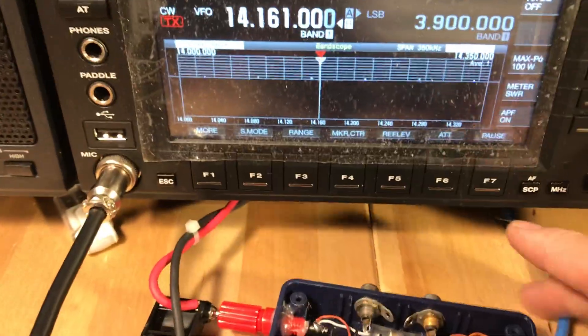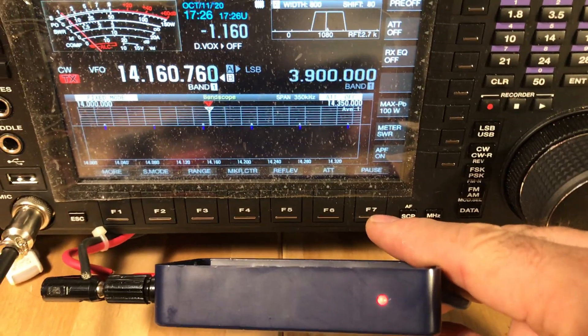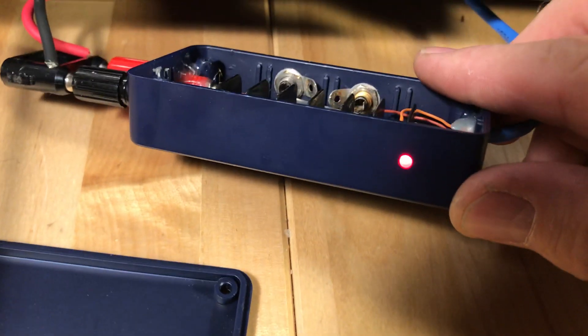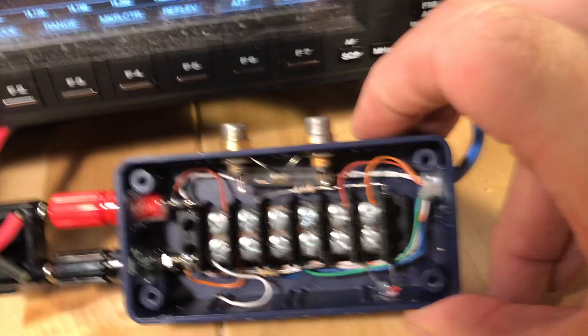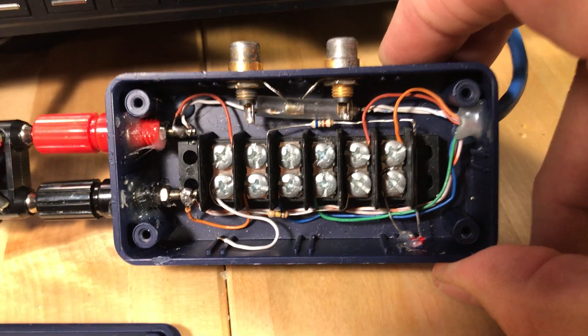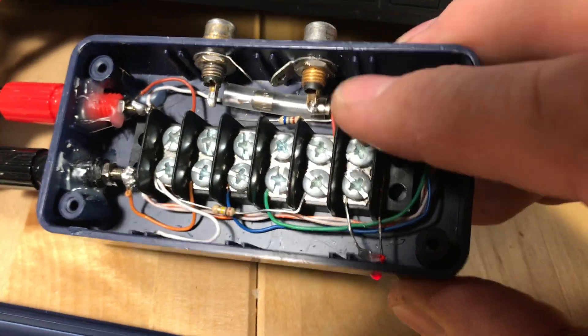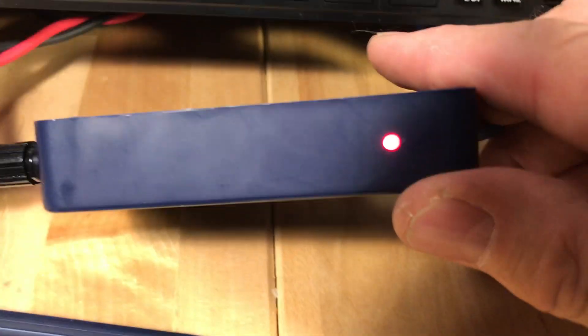So 20 meters. It'll probably jump up real quick as it tries to get the information out of memory. There's some RF feedback or something going on. When it gets tuned, it should shut that light off, but actually it's still a little bit dim — it doesn't go all the way out. That could just have to do with the resistor dropping that I have. The logic they use inside the box to control the push-to-talk line is kind of whacked, and that's what we're looking at here. I built this a while ago.